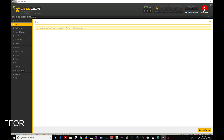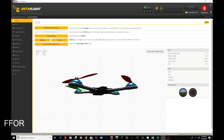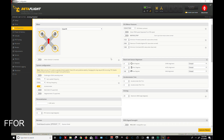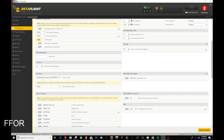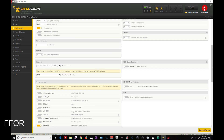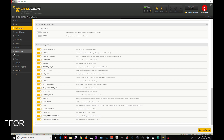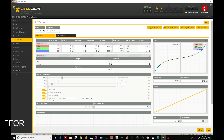That's it for the F3 board. Going to pause here and jump over to an F4 board for a few more options. So we're back with an F4 board — same thing, I do have the accelerometer working on this one. I can't click Ports because it will still give me a firmware issue. In configuration, I always set my minimum lower on this one. 8K, 8K accelerometer. CPU load is a little bit higher — not that 8% matters, but it's normally 6% on Betaflight 3.4. Dynamic filters are on, anti-gravity OSD. When we go to PID tuning again, you do have iTerm Relax — this is roll pitch, roll pitch yaw. I'm not sure what increment only is, but I think that's the filtering versus interpolation.